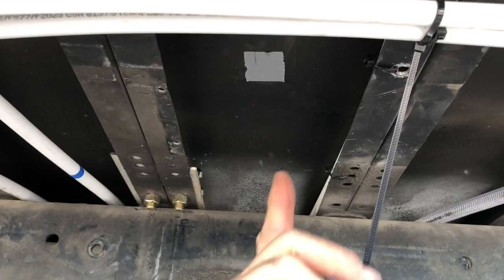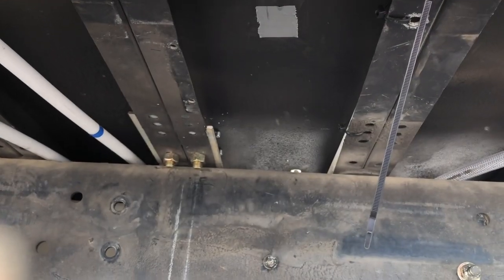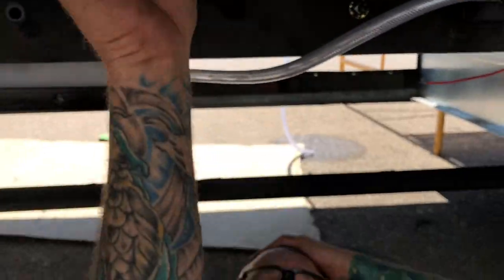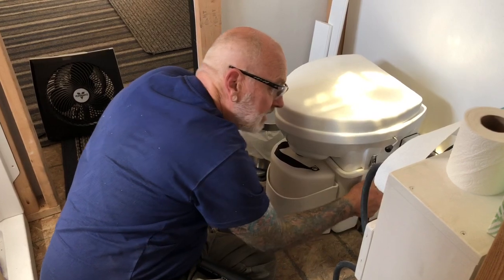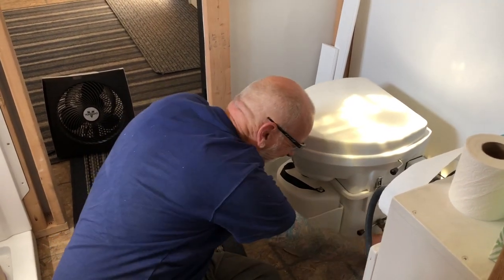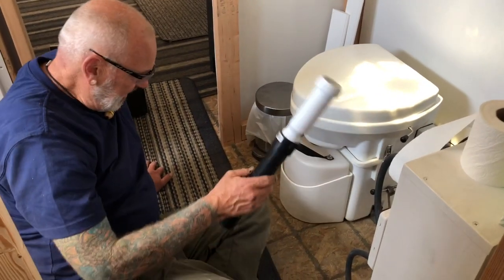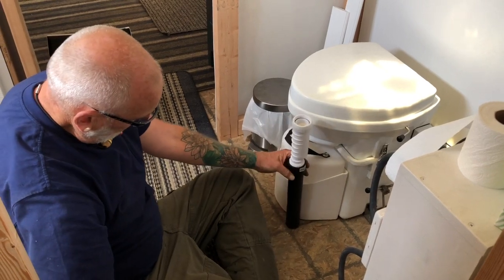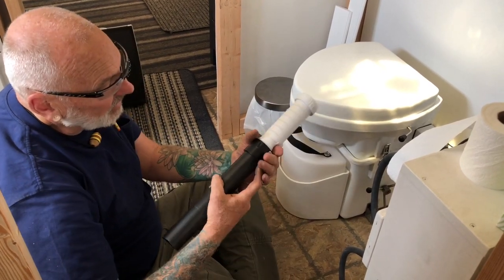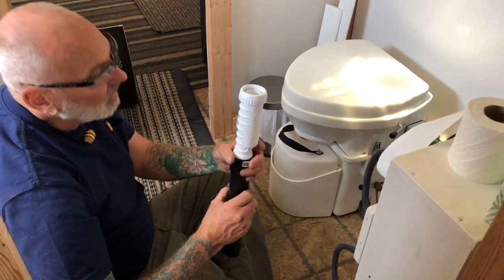We should put a little piece of tape right there. We can make this come down, go over, and tee right here, and then go down — those can both go in together. That'd be really clean. That's the sink line. I've seen other guys do this — they put it right down through the floor, which would work great because the hole saw will cut a hole and that flange will hold it up.